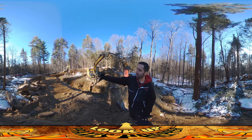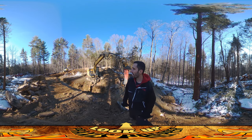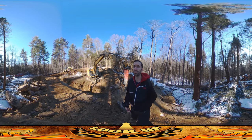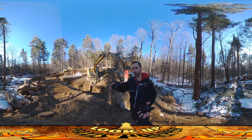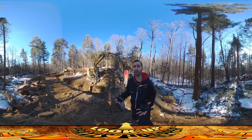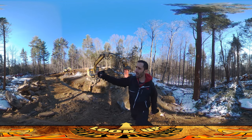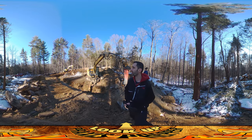My contractor is over here finishing off the last of the ledge. We're trying to clear out as much as we can before we put the wall over there. The next step is to put crushed stone down on the bottom, and then we're going to put in what's called the footing forms. The footing forms are the concrete forms for pouring the footing — a really large mass of concrete at the bottom of your foundation wall. It's the foundation of your foundation, and it gets laid right on top of the crushed stone.